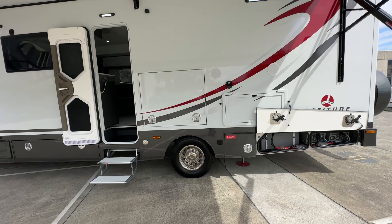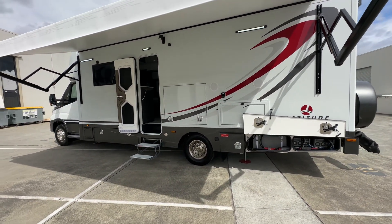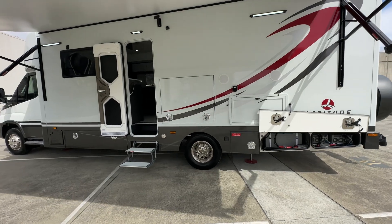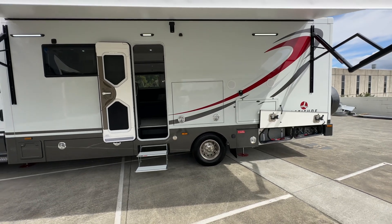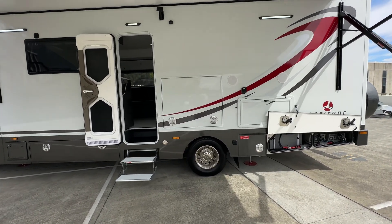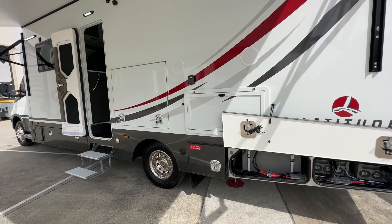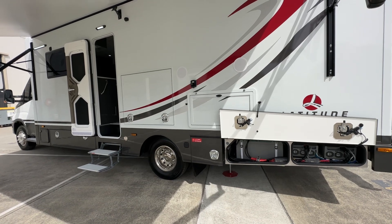This customer however had some more requirements. They came to us with experience from other motorhomes and caravans — they were overloading the power point in the caravan park, and when they went free camping, they were running things very low very quickly. So they wanted us to come up with a solution to address that. What we did is come up with a system that essentially floats the 240 volt power above the mains connection, so mains charges the battery and then the inverter supplies the power inside.